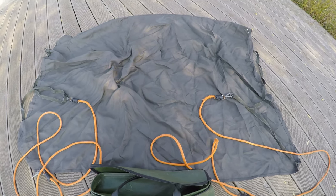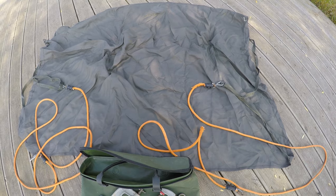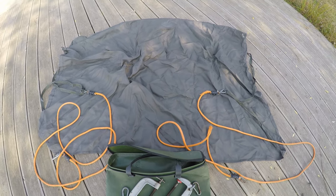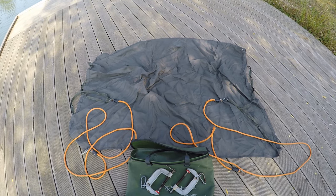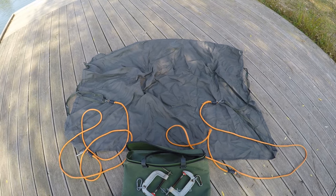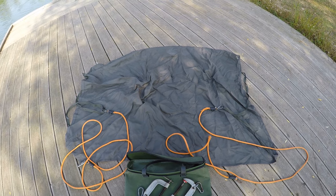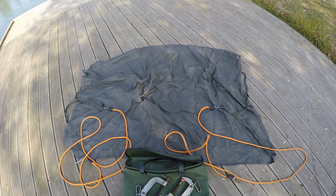The original ropes that came with this have since worn out and broken through use, so I've replaced them. As far as length of drogue ropes go, these ones are between 10 and 12 feet long — closer to 12 feet — and importantly they're both equal lengths. Too short and the drogue won't set properly, especially in a big wave — it'll ride the wave and won't dig in. Too long and the drogue digs right in but doesn't respond quickly to changing wind direction, causing the boat and drogue to go in two separate directions with a lot of jerky responses. Between 10 and 12 feet is absolutely ample.